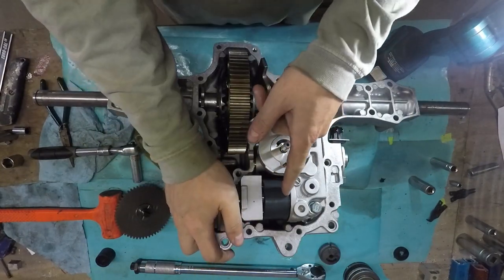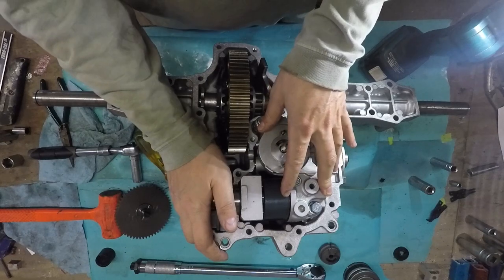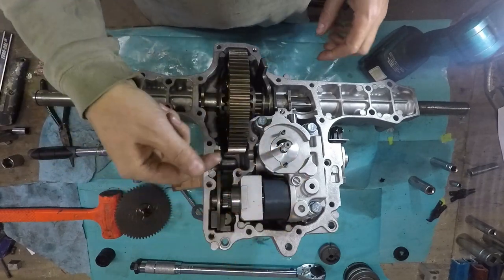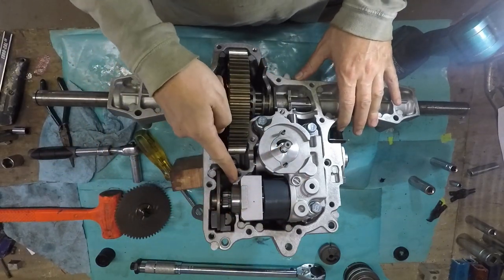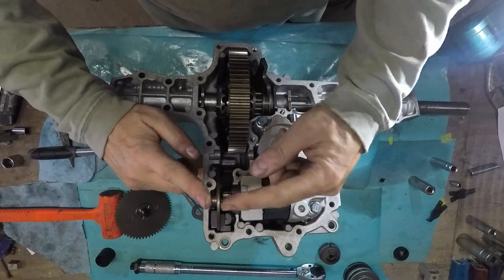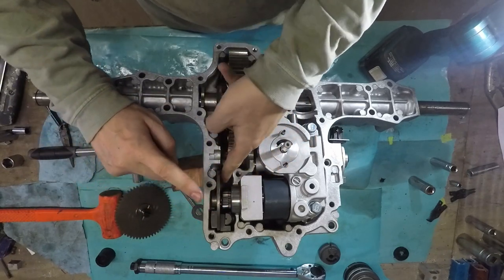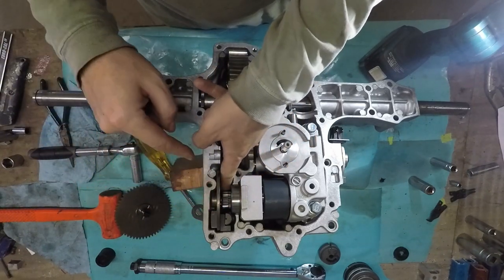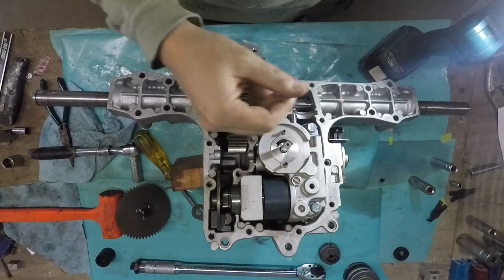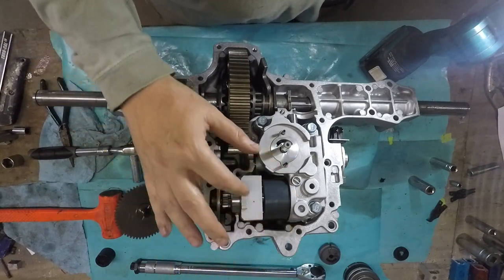So once you tighten it down a little bit and you check the freewheel, if it doesn't look even all the way down through and up around the top when you put it on freewheel, I bet you this bearing over here, you didn't push it in quite far enough, because there's a little tiny lip at the bottom of this case. Here's the bearing, and it sits down just in this little lip. There's a little lip that sticks up. I can't show you. It's up underneath of here, straight down at the bottom. And it kind of sets in there so it's not able to go out. It was just on top of that little thing. It's not very big, but it's enough that it would misalign everything.